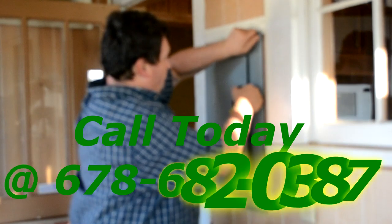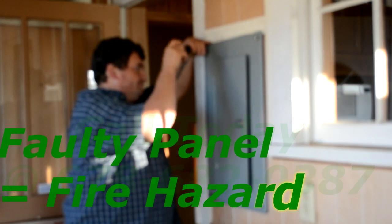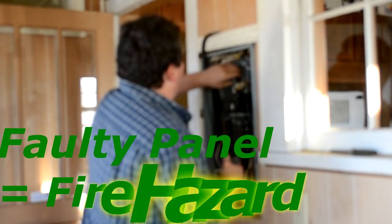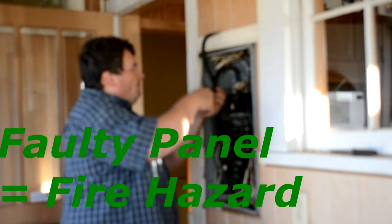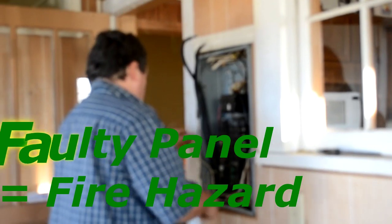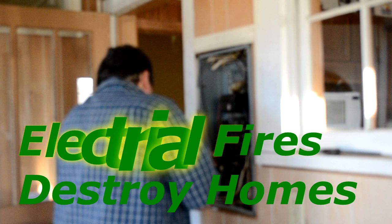Now, Michael is taking off the cover for his interior electrical panel. It's a 150 amp panel. We're going to pull the cover off now and begin to take out the old panel. Michael is taking the feeder wires out of his 150 amp interior electrical panel. He's loosening these main lugs with Allen wrenches. You can see he's careful not to skin the insulation on the existing wire. He's already loosened all his breakers.